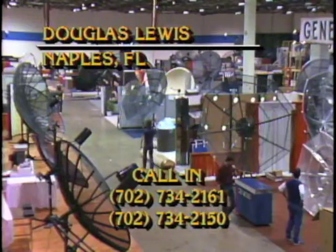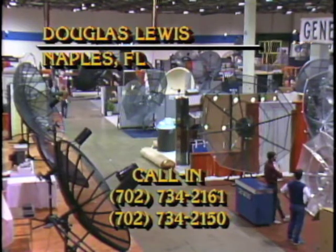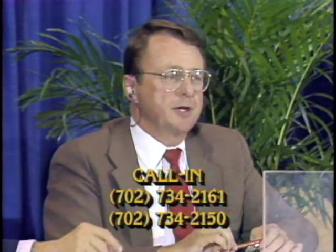After you purchase your scrambler, how are they going to charge that monthly service to you, and how will they control that? How will they turn it on and know whether or not you've paid the monthly payment? Well, basically that's pretty simple. You buy a decoder and it has an identification number, like your Social Security number. And if the cash flow from you stops, they stop sending that number over the satellite channel that you're watching, and you therefore no longer get authorized to watch. Does that hit the question?